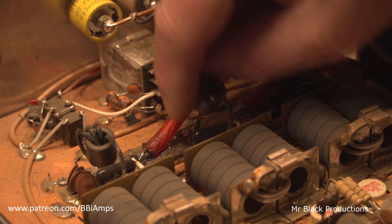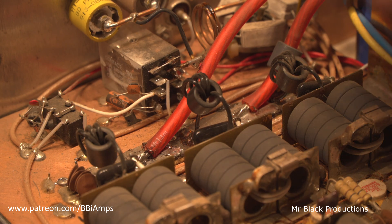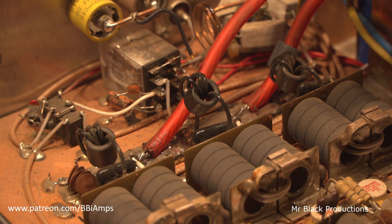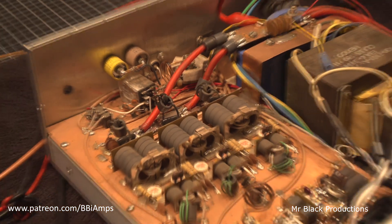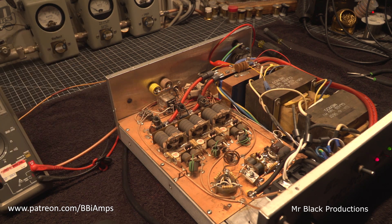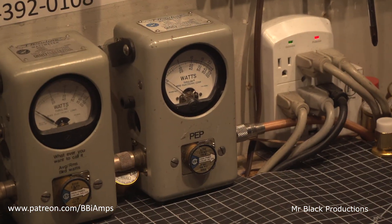So you lose a whole volt's worth because everybody uses these small wires. This is a phenomenon that I studied and figured out we needed to do something differently, about a decade ago. It came back to my attention tonight because I haven't been in this box in probably seven years. I'm in here replacing the rectifier pack — it had little 50-amp bullshitting rectifier packs in it — and I said I've got to change these resistors in the corner, and while I'm at it I'm going to put a power wire upgrade in.